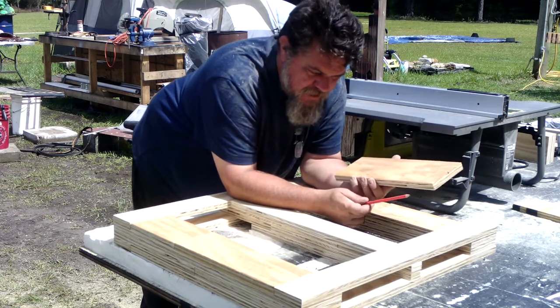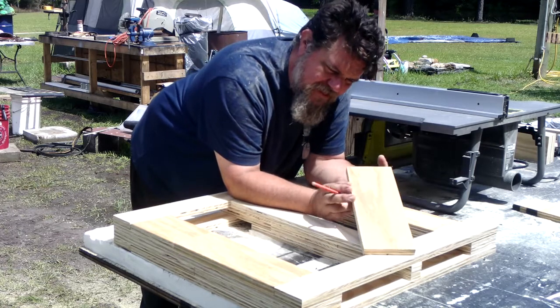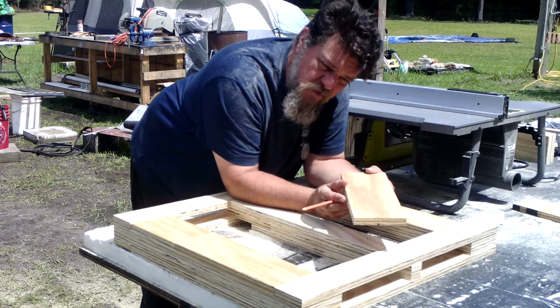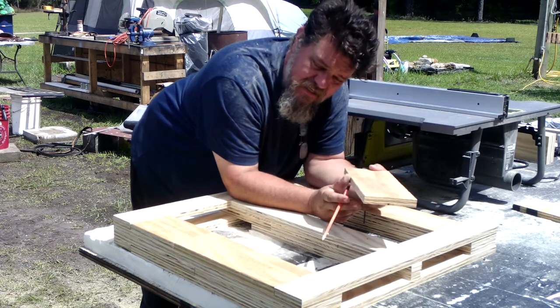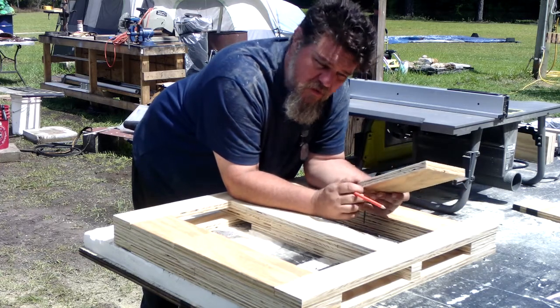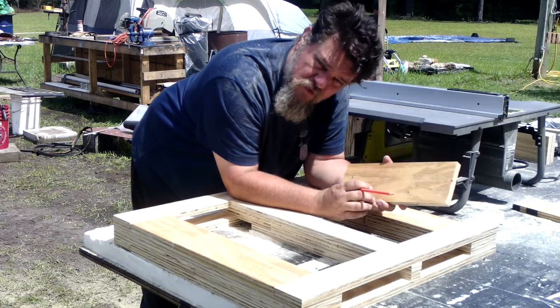So this is basically a stack. Now the benefit in it being 4 inches wide, it doesn't actually need 4 inches wide, but that adds stability. Because we're going to glue and screw the heck out of this all the way down, the entire base basically becomes, essentially, a 4x4 piece of wood that we've cut to the sizes we want, milled it, and are gluing and screwing it.